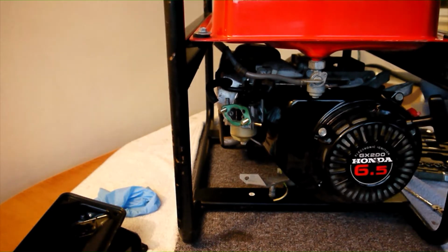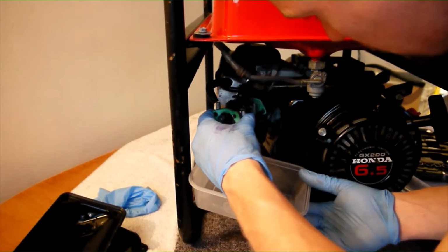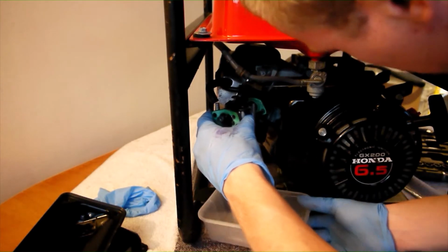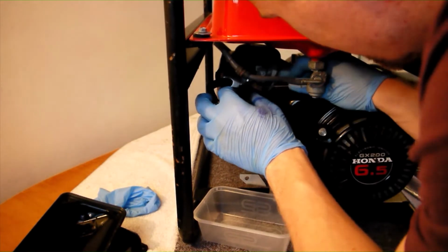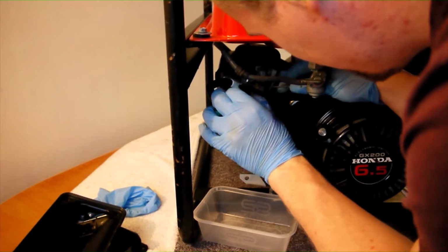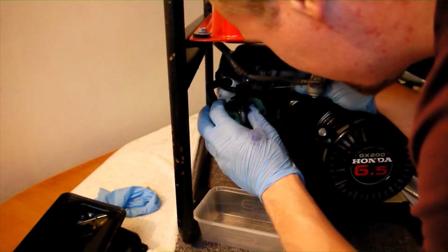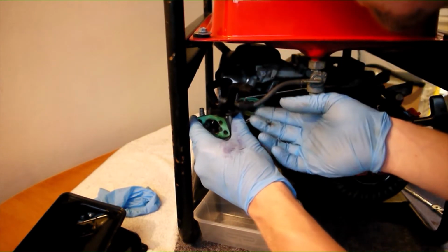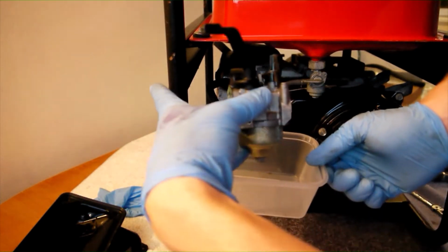A spare food container is also useful for placing underneath the carburettor on removal. You may wish to drain the carburettor beforehand, but I personally do not bother, as we will be stripping the carburettor down in a moment anyway. The throttle linkage is the last item to disconnect. A spring is used on the linkage to remove any backlash. Unclipping this spring allows the main throttle actuator lever to be disconnected from the carburettor, which can now be removed from the engine.